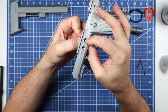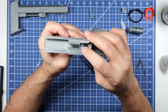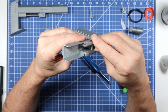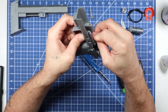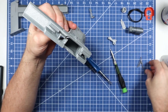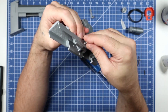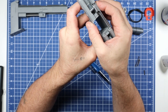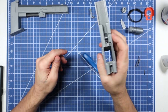Hold the trigger with pressure on both sides, let it come up slightly to allow the linkage to clip on, then push the whole assembly down. Insert a 20-millimeter screw from the side through the trigger hole and you can let go — the trigger is now held in. You'll see the linkage movement; that small motion is all we need.